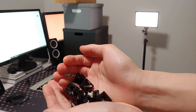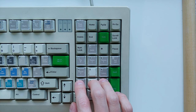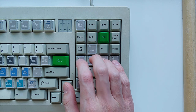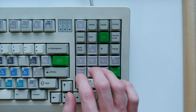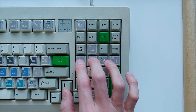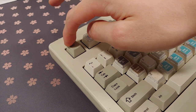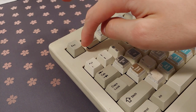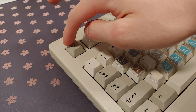So to improve on this, let's first examine the three flaws of the MY switch. The first and most obvious is the spring weight. I think these are supposed to match Cherry MX Blacks, and as such are significantly heavier than typical switches. I find them fatiguing to type on for more than 5 minutes. The second is the problematic roughness and often binding on off-center key presses. Even for 1U keys, the issue is noticeable and really gives the board an unrefined feel.